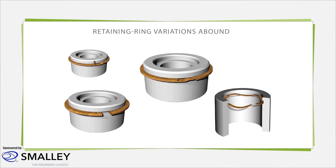Stamped retaining rings are manufactured from sheet metal and feature twin lugs, sometimes called ears. These are the most cost-effective retaining rings when working with small diameters. However, the stamping process generates excess scrap, causing them to be less cost-effective when working with larger diameters. Stamped rings are installed with the help of snap ring pliers, which are inserted into the lugs to separate or compress the ends so the retaining ring can clear the shaft or bore. Stamped rings can replace cotter pins and other traditional fasteners in a range of applications.